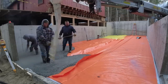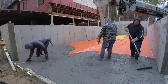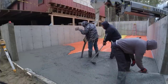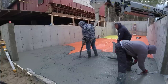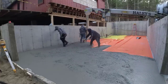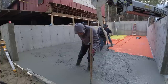One of the keys with pouring concrete in the cold is you've got to keep that sub-base from freezing before you get there. This happens to be all crushed rock with styrofoam over it. Definitely don't want to pour on anything frozen. These guys own a bunch of concrete blankets — they keep the sub-base covered beforehand, then cover the floor afterwards. You've got to keep those blankets from blowing off for two, three, four days, even a week sometimes, to let the concrete cure.